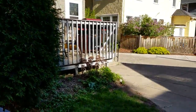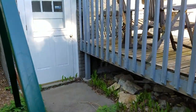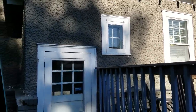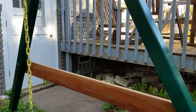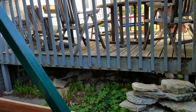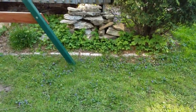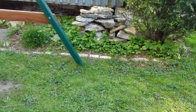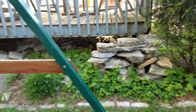I'll come over here so you can get a gauge — that's the end of the deck. You can see this door; it's going to come to the edge of this area over here. The back area is not terribly wide. He mentioned window wells but actually there are just windows, no window wells. This is more for Nick — we need to make sure we line up the correct grade. The grade is going the wrong way, so we may need to dig a bit deeper to ensure water doesn't go back into the house.